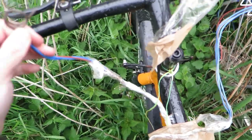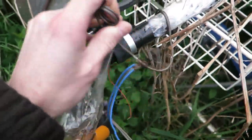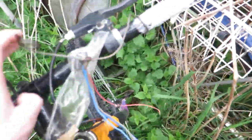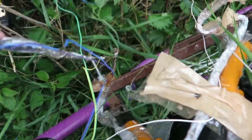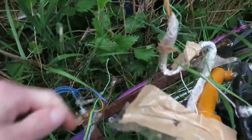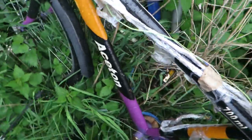There was also no speed controller or anything. Switching was done literally by contacting two wires by hand. Sometimes the contact wasn't very good and you burn your hand. There was also amp meter mounted on the steering so I can see the power of motor. This motor was meant to run at 500 watts at maximum, but the test ride was at 250 watts during high load and about 100 watts at leveled terrain. Test ride was done obviously at night outside of civilization.